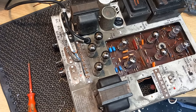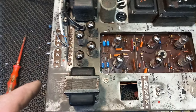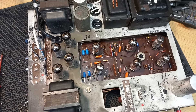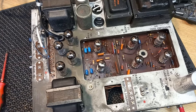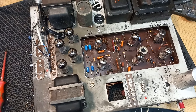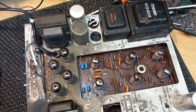Have a listen — it sounds quite nice, but there's still this noise floor issue. I've done other similar Wurlitzer stereo amplifiers, like the 2300, with a separate mains supply, and I've never had this background hum or buzz problem — more of a buzz, actually, which is usually related to heaters. I've tried every trick in the book to make this amplifier quieter. It's 100 times quieter than when it came in, but in my opinion it's still not as quiet as an amplifier should be — it shouldn't have any background noise at all. Everything checks out: all the voltages are correct, no obvious faults, but I just cannot get rid of this background buzz.